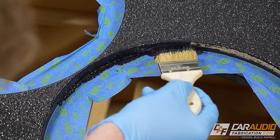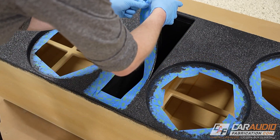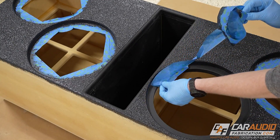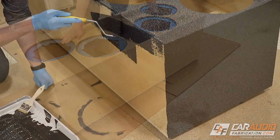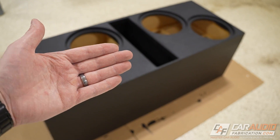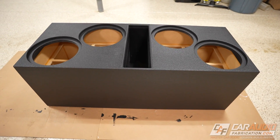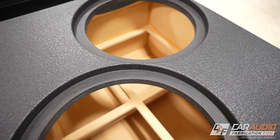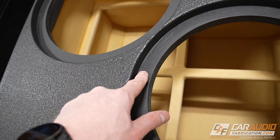On this area of the flush mount baffle, I'm using a brush to apply the coating, and I use a dabbing motion to give it that textured look. Here's a big one though: I want to make sure that I remove any of the protective tape while the coating is still wet. Once this coating sets up, it is extremely strong, which makes it impossible to remove the tape. Going back in time a second — before I had even started, I had set the enclosure on top of spacer blocks, and this allows me to get the coating around to the bottom edge of the enclosure. I also coated the bottom off camera, and after ample drying time, here we have it: the completely texture-coated subwoofer enclosure. It just looks so nice and clean, especially since we took the time to prepare and mask off the areas we didn't want the coating, giving a nice clean finished look between the texture coating and the flat black paint.